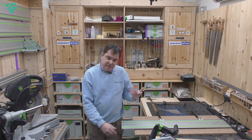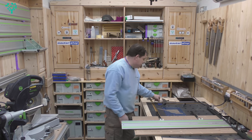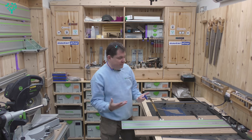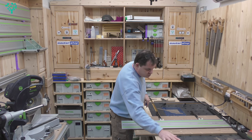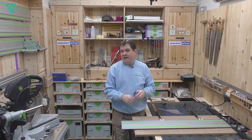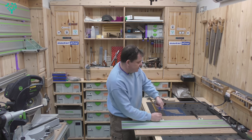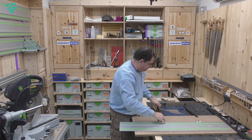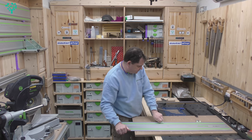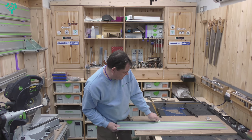That gives a simple solution for a capacity of zero all the way through to 1180mm. But you're probably ahead of me — I took these rails off and now they're no longer calibrated. So while the narrow cut guide is a simple solution, in my workflow that could give problems: I'd make long cuts first to rip down the board, then bring in smaller cuts for the project, and I'd have to take it apart and recalibrate. So I was thinking about that and wondering whether we even need to worry about the under-rail system.